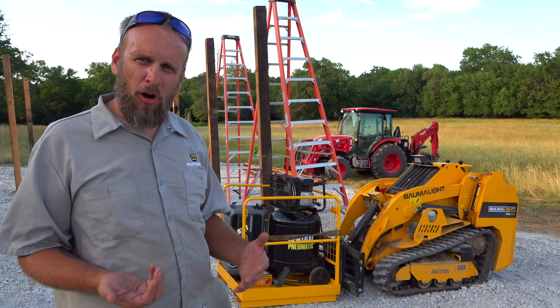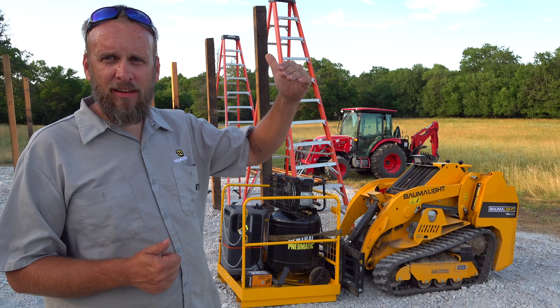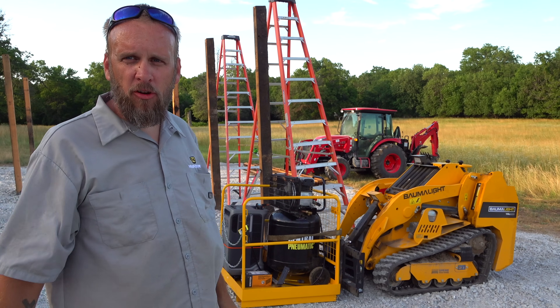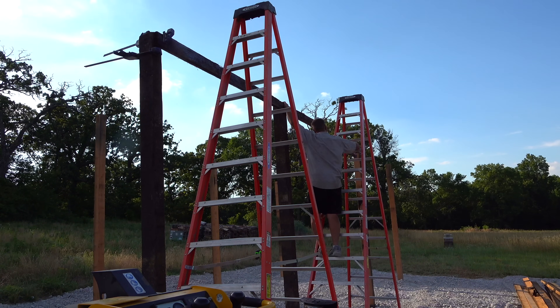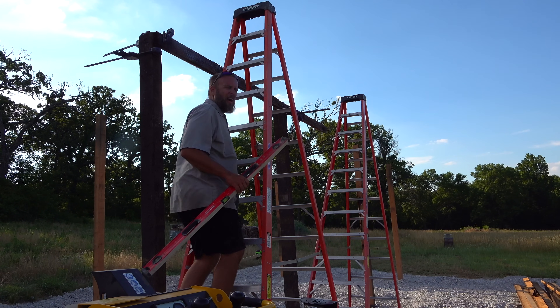These boards are rough-cut hardwood and they're going to be heavy, so doing this by myself with a sore back I want to be smart. What I'm going to do is clamp a clamp on each end that the board can rest on — put a clamp up there, set one end of my board up, then walk up the other end and put another clamp on it, so I'm never trying to lift the full weight of that board or carry it up a ladder. I've got a feeling you guys are going to tell me a hundred easier ways to do this.